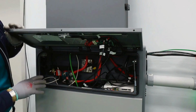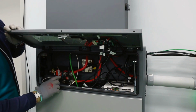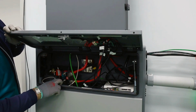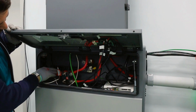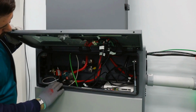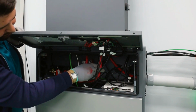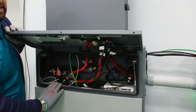represents the interconnection well because you see the positive bus bar here and the negative bus bar there. So the positive bus bar, as we've discussed when we were going through the presentation, it has originally 4 different ports. One of them by default is always occupied by the default connector. This one is responsible for connecting the eForces in the stack to the bus bar. So 2 of them are occupied, one by the inverter positive cable and one by the second eForce positive cable. And the same is the case with the negative bus bar.